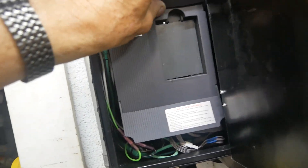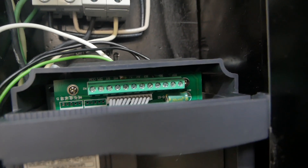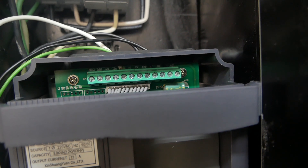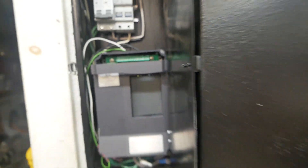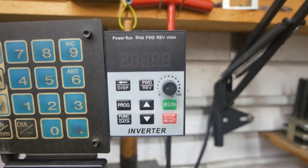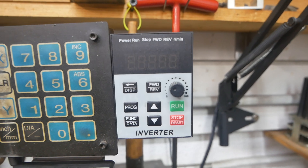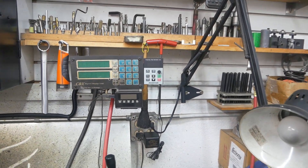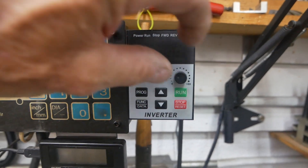It's really simple. Up on the top of the variable frequency drive there are screw terminals. All you need to do is take a simple on/off switch, wire one leg to common and one leg to screw terminal number 4. Then go to the control panel and program it — go to program number 11 and set it to function number 2. Once you do that, the only thing that works on the control panel is the speed control knob.